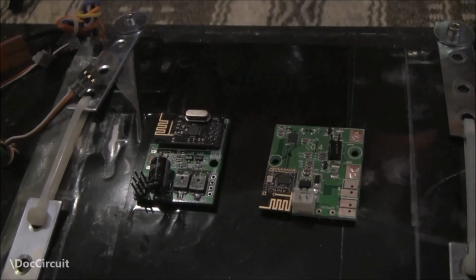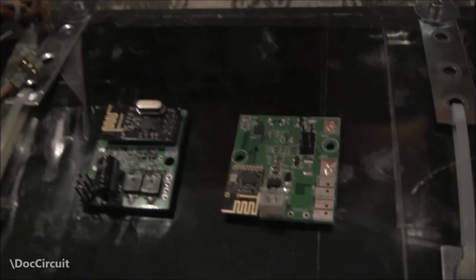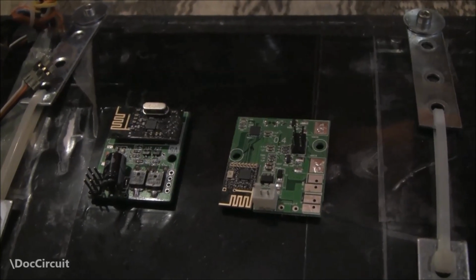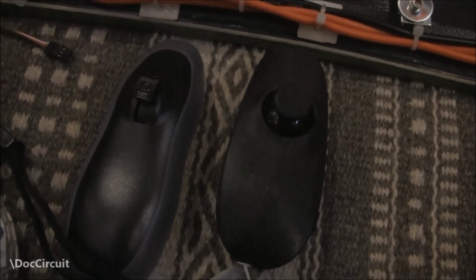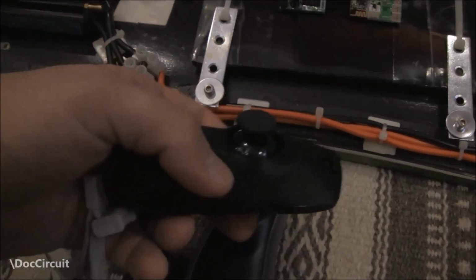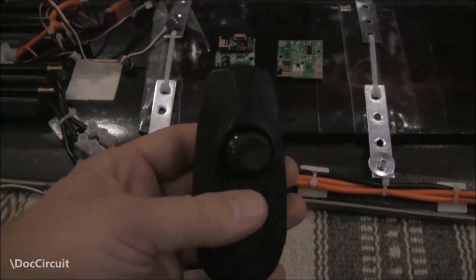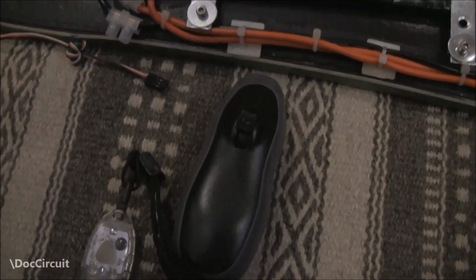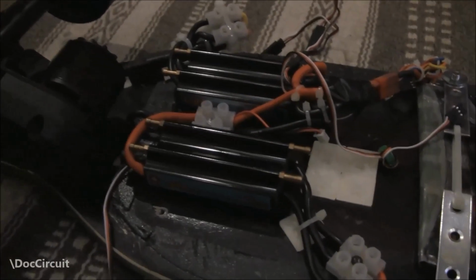This was really a stab in the dark. I tried different receivers. One of these is from the first generation, one's from the current generation of Chinese clone electric longboards. You can tell from the different hand controllers, but nope, that didn't change things at all. Weirdly, programming the speed controllers, if I was to do it manually, not via the program card, the first generation hand controller had a better time of it than the current generation. But that doesn't matter, because I don't recommend these.